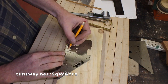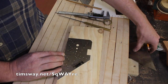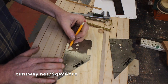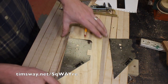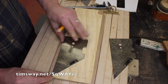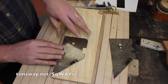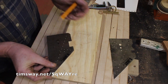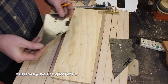These holes here form a protractor. I did it in 5-degree increments — I couldn't include every step you might need. Again, it doesn't replace a protractor; it's a quick protractor for when you need one. I put them in 5 degrees: 5, 10, 15, 20 — and I also put in 22.5 and 31.5. The way it works is you put your tip in the corner. Suppose I wanted to make a 22.5-degree cut: I go to my 22.5-degree hole, put a little mark there, then spin this down and measure from the corner to the dot. And there's my 22.5 degrees.